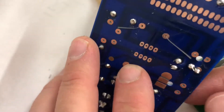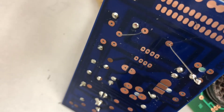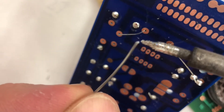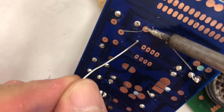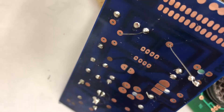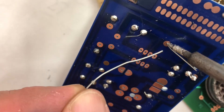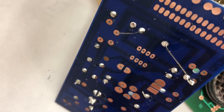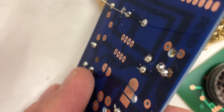Find a steady place to work. Clean that solder iron and tin it up — for this one we're going to use just the very pointy tip. Get a bubble on there, then touch the copper ring and the resistor lead: one one-thousand, two one-thousand, three one-thousand, four one-thousand — touching the metal, not the solder iron — then boom. There's one that looks like a Hershey's kiss with the wrapper sticking out. Put another bubble, touch the two together while pushing down, and away it goes. Flip it over to double-check — it looks like a Hershey's kiss.